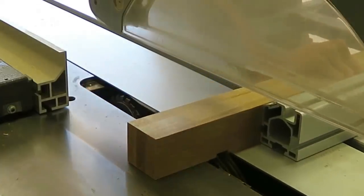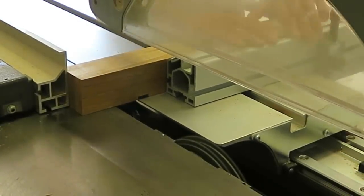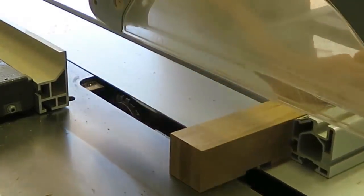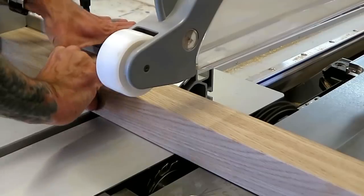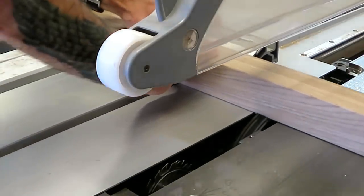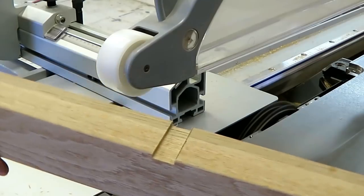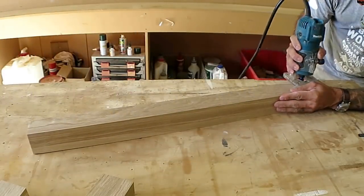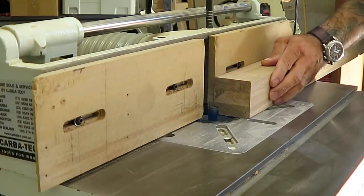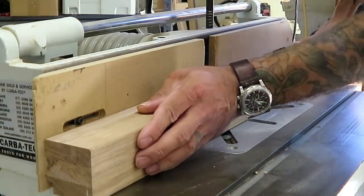I needed to add two dado grooves, one for the bottom slatted shelf and one further up towards the top of the leg to hold the actual base of the carcass itself. I added a nice little roundover to all the edges of the legs. And on the back corners of the back legs, I had to add a rebate to take the backing board.